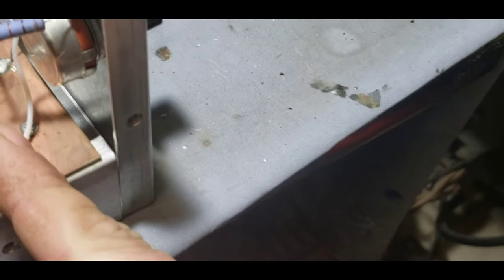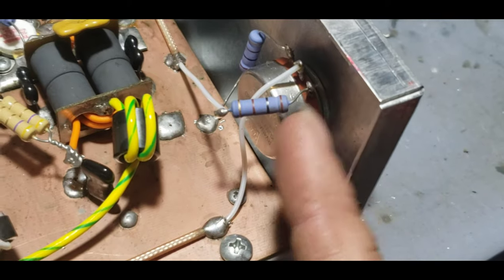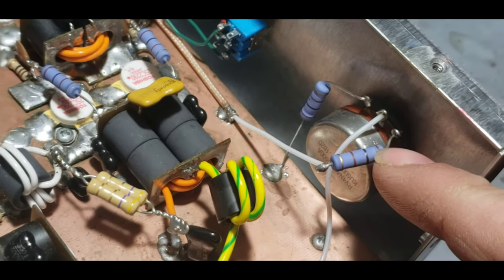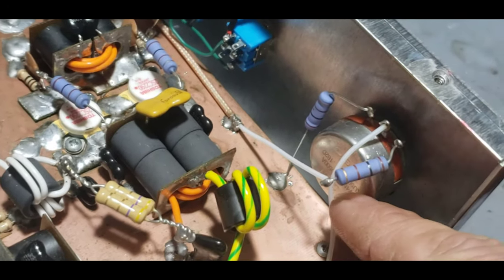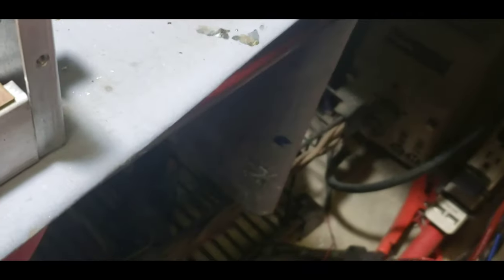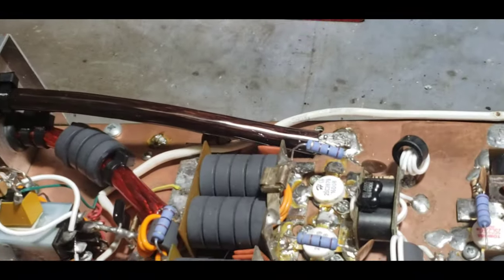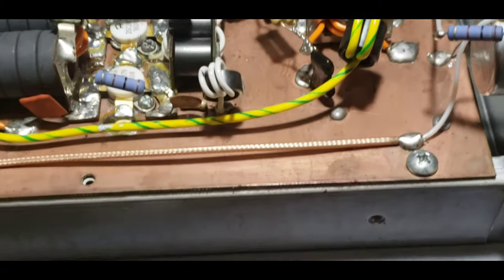It's good to try to make a T-circuit attenuator just with the variable. This right here is the series, here's the shunt, then you got another series right here, so it's being fed right there in the middle. I'd have to draw that out — I think it's probably just an L-circuit. This may just be an amp somebody built in an ICA case. I don't normally see Fat Boy doing their layouts like this, so I'll rephrase that to a homebrew somebody put together.